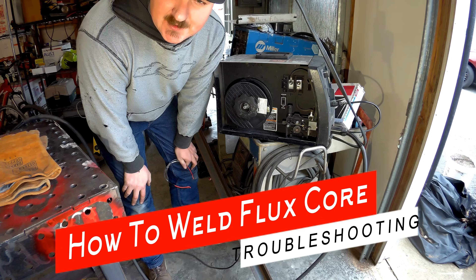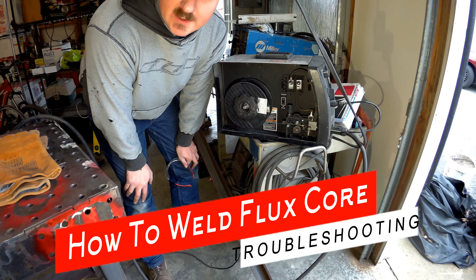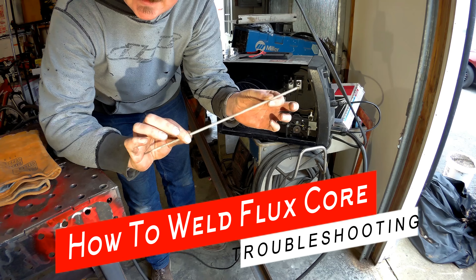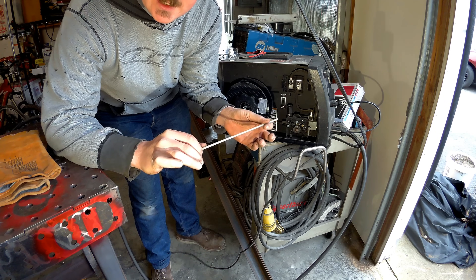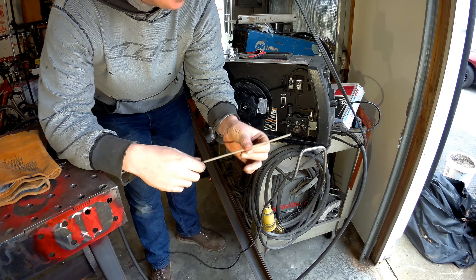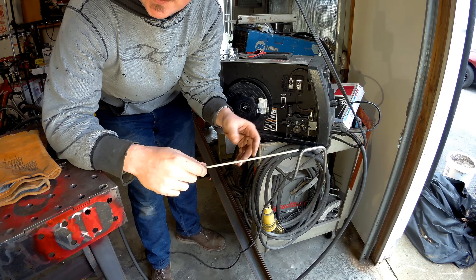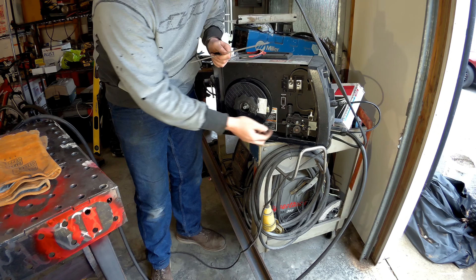I just wanted to take away some of the mystery and share with you guys one process of welding called flux core arc welding. I really think it's the best solution for the home welder. Flux core is a lot like stick welding — this white stuff on the outside is actually the flux. When you superheat metal and get it to melt into a liquid, it gets really reactive chemically. This flux material basically protects the weld from oxygen and other chemicals while it's superheated, and flux core has that same flux on the inside of the wire.